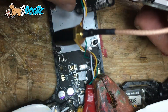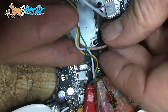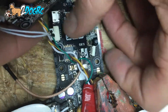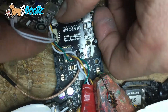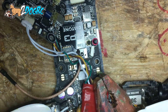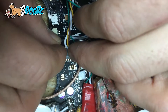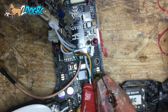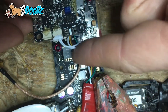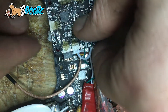Then to put this back together — this goes on the bottom. I want the white wire to go in between them, so we'll just put this back on the stack. We'll take our little purple spacers — red or magenta, depends what color you want to see. Put those on here. That just gives you space between them so you're not crushing the boards when you tighten this down. I put this wire going to the OSD under the flight control board to keep it out of the way from getting yanked and pulled — secured a little bit.